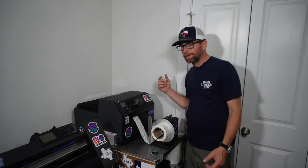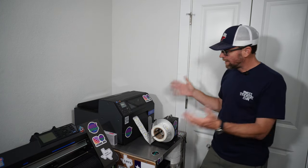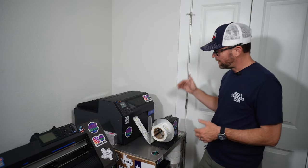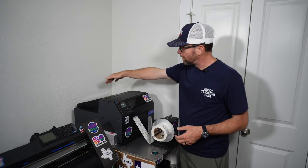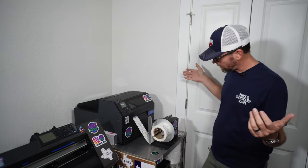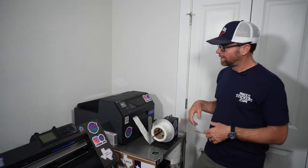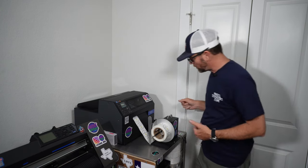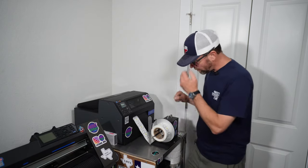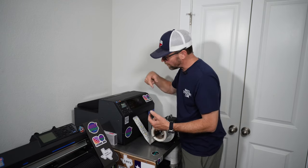It's about to run out of labels. It sounds horrible, like the machine is breaking, but it does that every time — it's just the spool on the back jumping up and down. It hasn't caused any damage in 100-plus times. It ran out a little short, so I'm going to put in a new roll. I open it up, tear off the rest, pull it through when I release the clamp, tear off the smeared label, and put a blank label underneath so the two ends overlap and stick together. I need to be careful where I place it because once it sticks, it's not releasing.